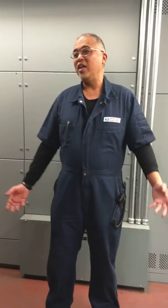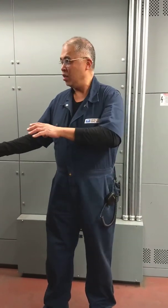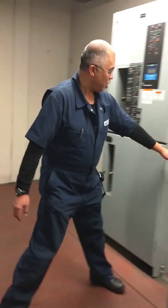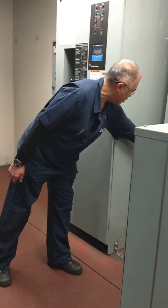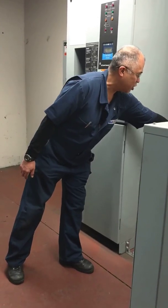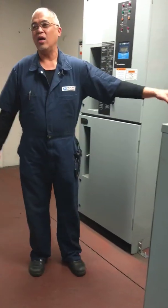It'll be circuit breakers for your stairways and for your lighting circuits on all three floors — lighting circuits, not every circuit. It's an emergency circuit, so not every light will be on. You'll have that dim blue light — that romantic light — only a few lights on. One way to find out if it's emergency lighting is to shut off all your lights; whatever stays on is on the E panel. You'll see labels like E2A4 or E2J — those are the panels that the circuits are going out to.